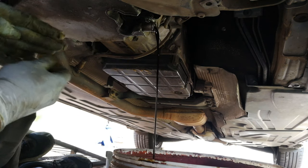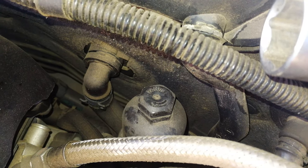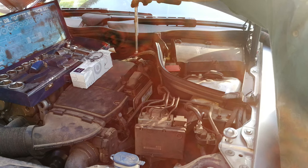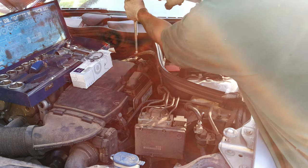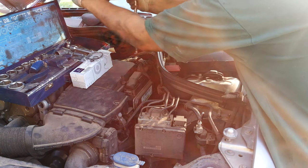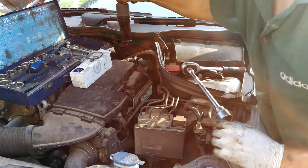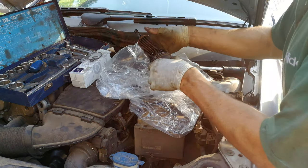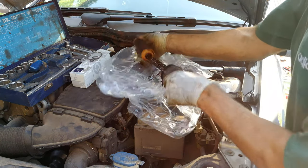Now, if you've got a busy workshop, once it starts dripping you'll close it. The oil filter housing is here at the back of the engine. You can see the size — it's got a plastic head and I'm going to now remove it. That is a size 27. So all you do is support it here and you turn gently — might be a bit tight. There's the old filter. Just be careful not to drip the oil. You peel this off like that — there comes the old filter.